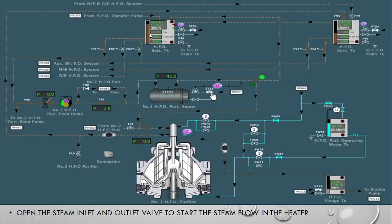The oil from the settling tank is coming out, going through the feed pump, being heated, and then via the three-way valve it is going back to the settling tank. So the purifier oil is in recirculation mode — settling tank to settling tank — and it will take a time of 15 to 30 minutes. So we have lined up the water, and we have put the oil in recirculation. Now we will start the purifier to gain speed.